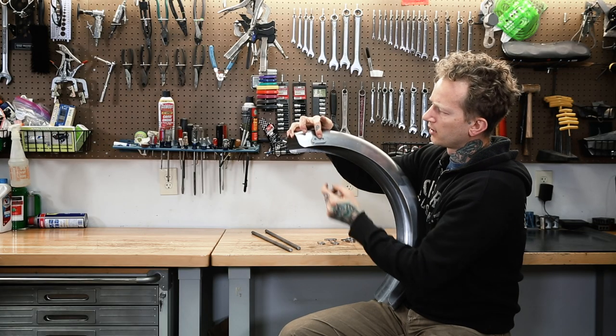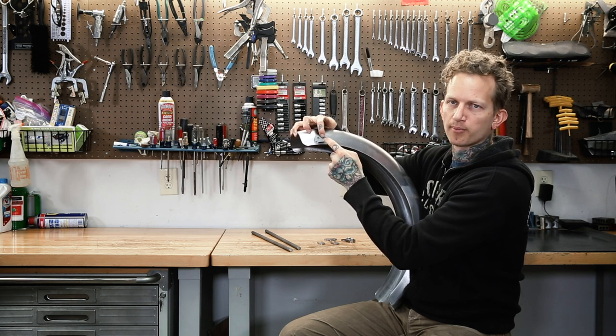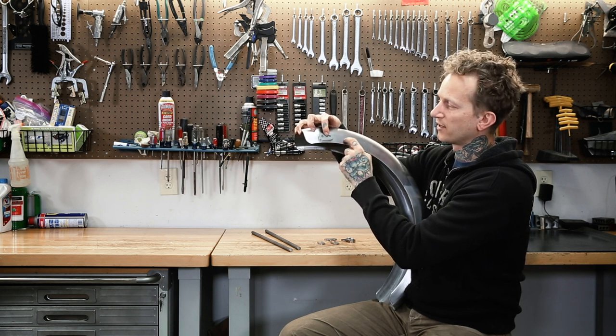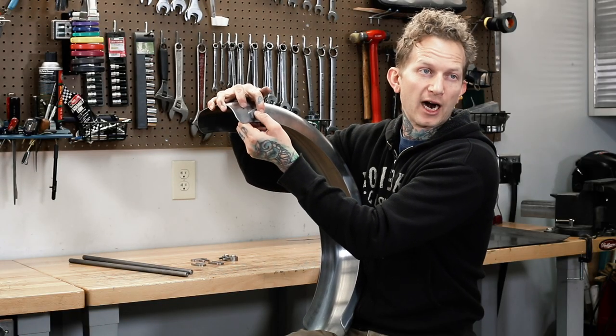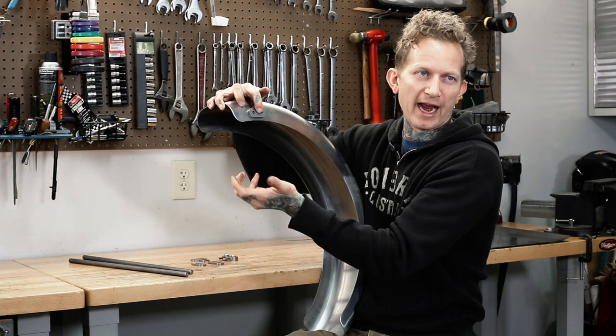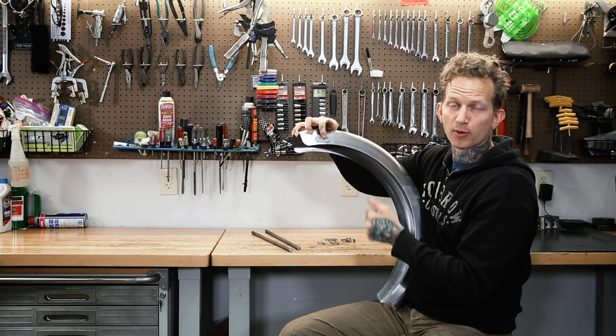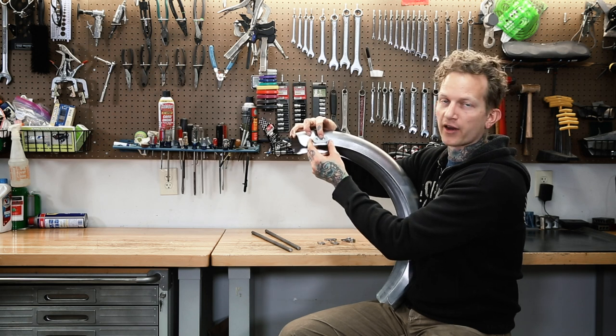So another thing you can do, these holes are on 1-inch centers. You can measure, mark, and drill 5/16 holes in your fender. Weld the tab in place over it. That'll allow you to run longer hardware if you desire, and even throw maybe a thin nylock on the back for added safety so these bolts won't loosen up. Though we always do recommend using Loctite on motorcycles on all the hardware.